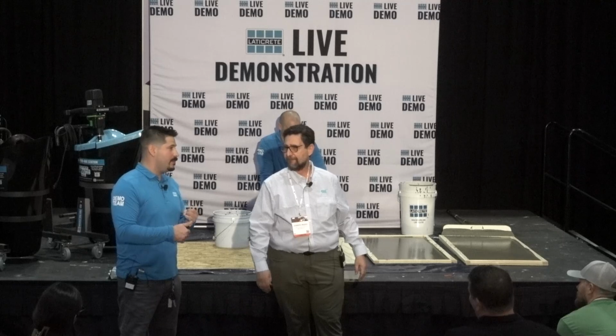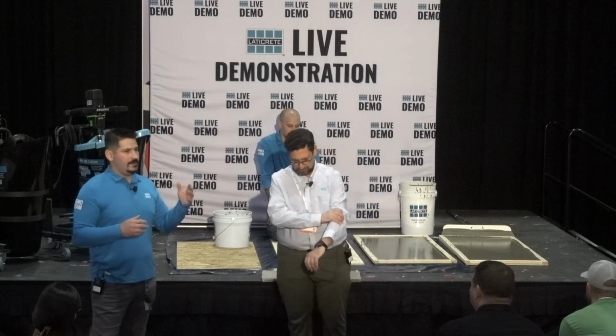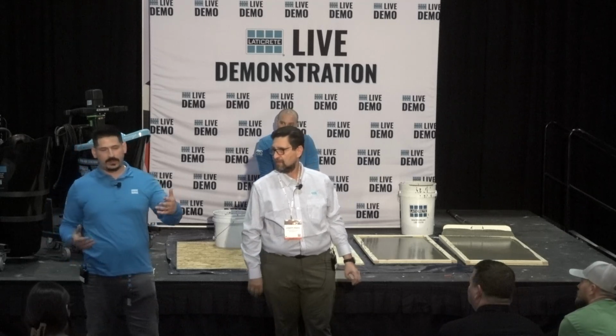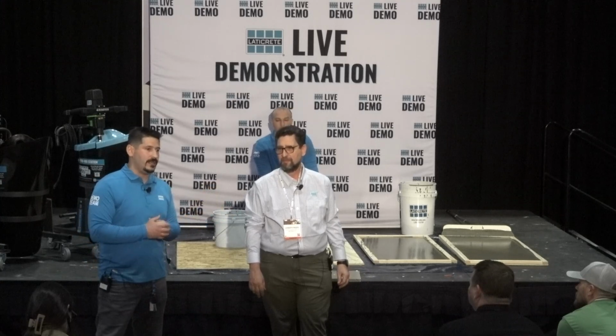We have our priming bond, which a lot of you in the tile and stone world would be very familiar with. That's our easy roll-on primer. It bonds to highly difficult substrates. So let's say you have a well-bonded substrate like tile and you didn't want to rip it up, you could just self-level over it by rolling it with priming bond and then self-leveling over it.